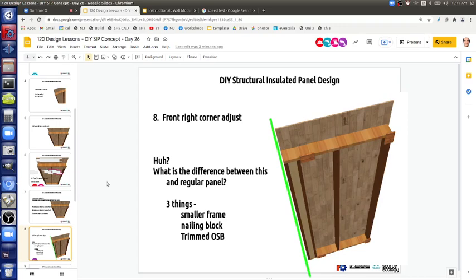In my mind, all you do is add. Yeah, but you have to replace add with subtract. You're shorter in the adjustment module. You're subtracting, so we said that it's 1.5 less, like you said. In case it doesn't align, in case you've got too much, the walls end up being a little larger, everyone adding a little more, so that the walls actually don't fit on a 32 feet. If they don't fit, we've done something egregiously wrong.